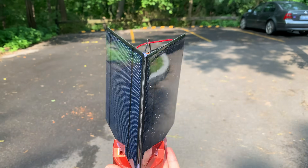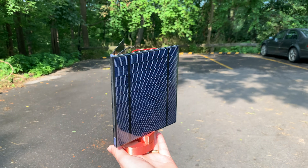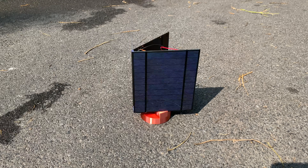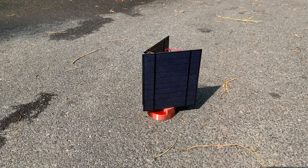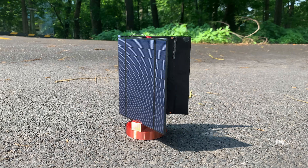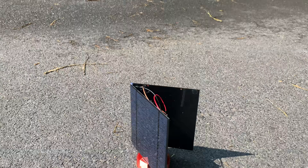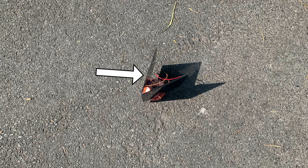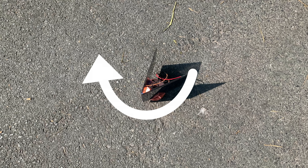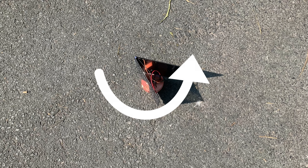Here's my first attempt at trying out the world's simplest solar tracker. You can see it's oscillating way too much — it's almost working, kind of pointing towards the sun. If we pause, you can see the sun is only hitting one solar panel, causing it to want to spin in that direction. When it faces the other way, the sun hits the other solar panel, causing it to rotate back the other direction.